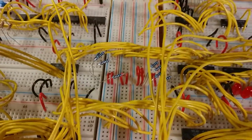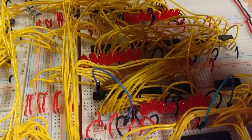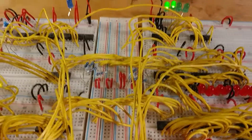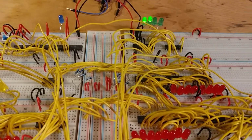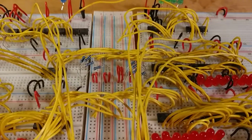And this is actually kind of interesting. This is something that I learned about from this project, pull up and pull down resistors. I don't remember that at all from DE, but essentially, electricity takes the path of least resistance. So if normally you have a pull down resistor, the default value essentially will be low because it's pulling it down to ground.